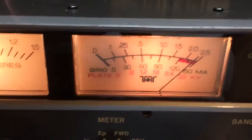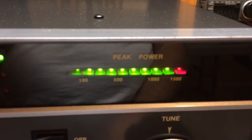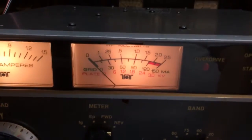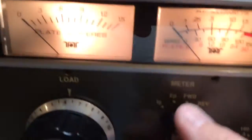We'll check the forward power on the built-in meter — showing about 1700 on the built-in meter. The PEP is pinned at 15+. We'll check the reflected power meter — it moves up about 25 watts. The reflected meter is a little sensitive, but it has been calibrated. At that kind of power level, it seems to have a slightly strange calibration curve.